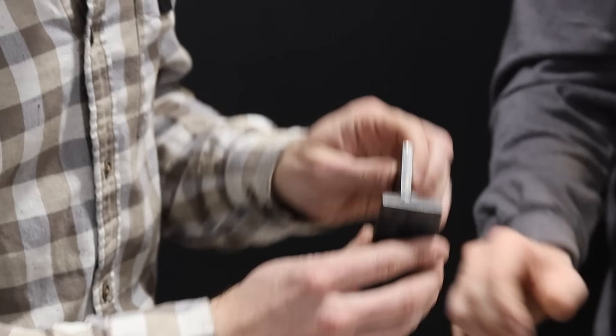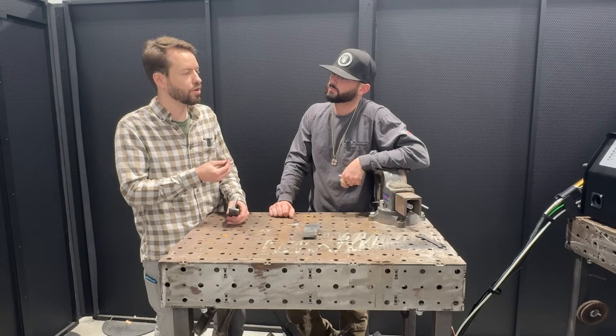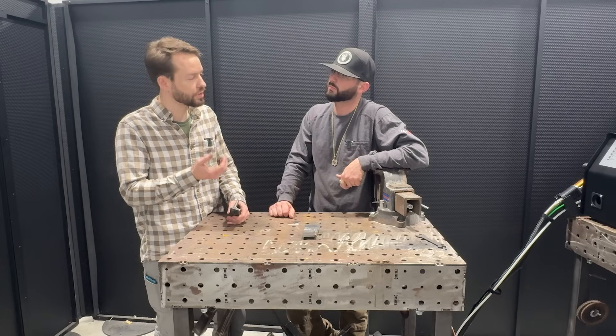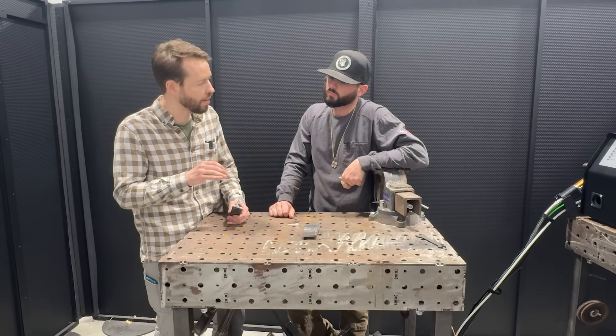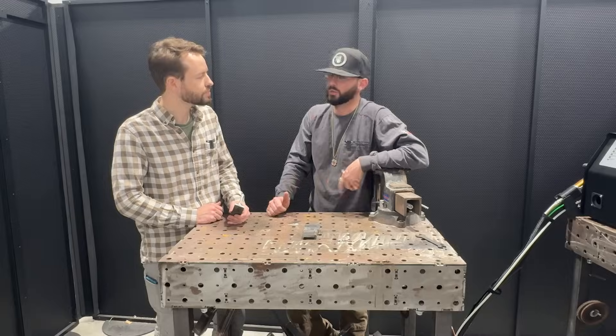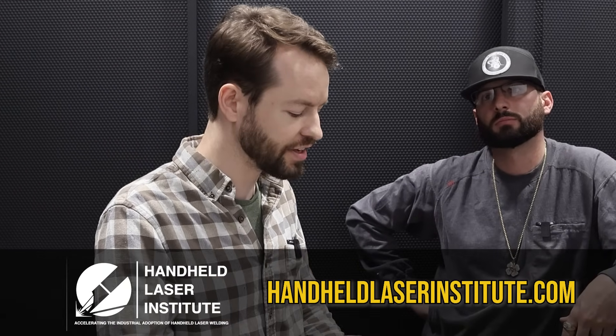It's definitely apples to oranges. I think if you were comparing your handheld laser weld to a TIG weld it would be more apples to apples in terms of fillet size. The other thing to keep in mind is that we used .045 wire, and that's going to limit our fillet size. If we used 1/16-inch wire or dual wire feed with 1/16-inch wire we could get a fillet that's maybe 60 to 100 thousandths leg length, but we'd still be punching in deeper — as we wobble wider, that rectangle becomes deeper and wider and we could punch further into the joint. Larger wire and dual feed systems require training, testing, and experimentation for the applications you're using it for. If you guys want to see more content with cross-sections of handheld laser fillet welds, let us know and we'll make some. Thanks for watching — we'll see you all in the next weld.